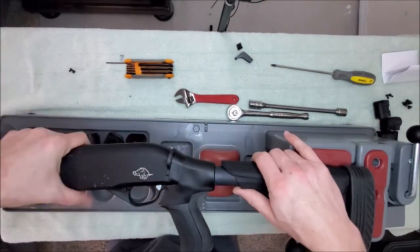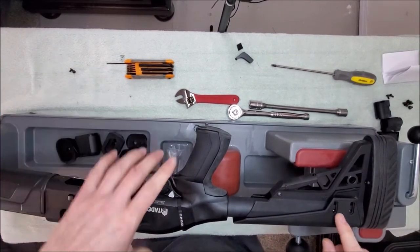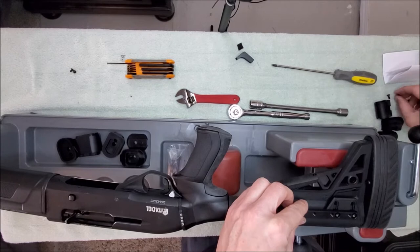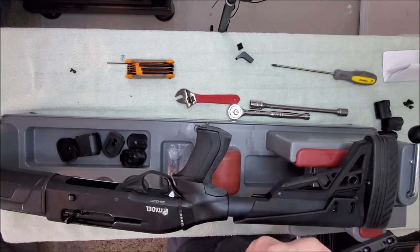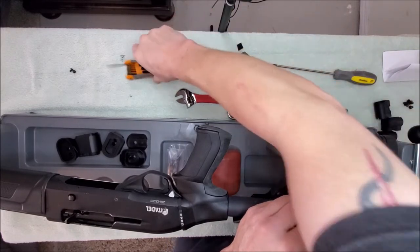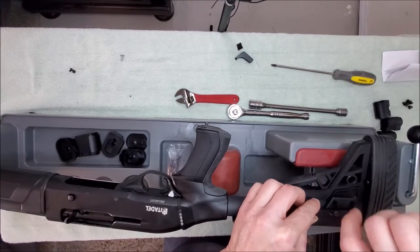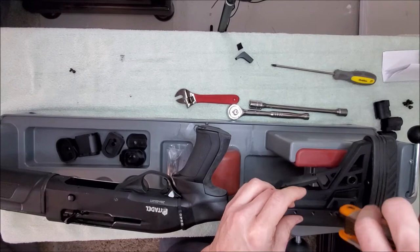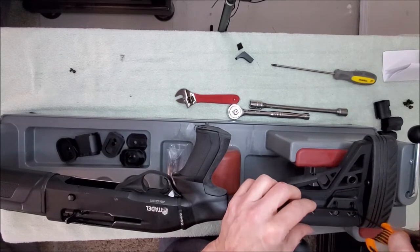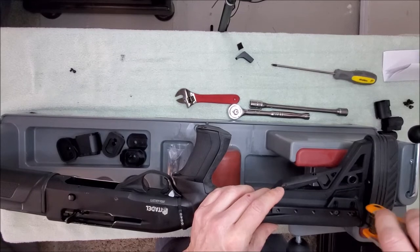I'm going to skip using these other two short screws because now when you install the shell carrier, you're just going to use the other two screws — pop them in right here and right here. For the shell carrier we're going to drop in these two long screws. This shell carrier also comes with its own set of instructions. We're going to drop these in here and then this will control your elevation of the cheek piece, just like the other two screws did.